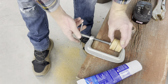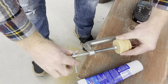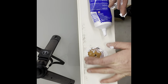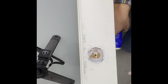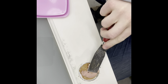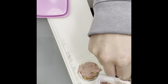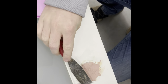The next day I attached the plugs into the door handle hole using the same Loctite adhesive and a small piece of paper as a shim so the plug would fit snug. I didn't use anything but the adhesive to attach the plug. Once the adhesive was dry I got the wood filler back out and began to fill the handle hole flush with the rest of the door, applying enough extra wood filler so I could feather in the transition to make it look like it was never there. And don't forget the spot where the latch would be — I did that the same way as the hinges, with a shim cut to fit.